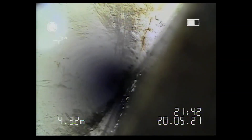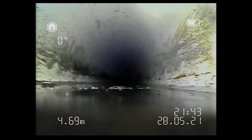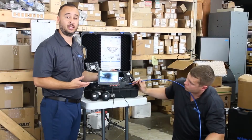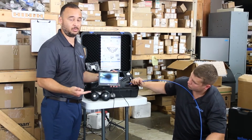The system comes with a hundred-foot cable, allowing a hundred feet worth of inspection area. Best practice is to find a clean out that gives you a shorter approach into the assembly you're looking for. Now we're getting into a little more water, which is completely fine for this unit because the camera is IP rated — it's waterproof. Both the camera head itself and the cabling are protected.